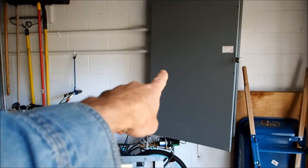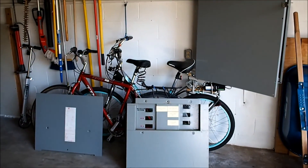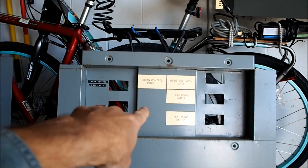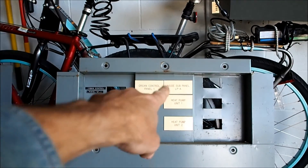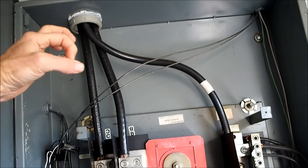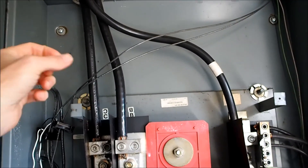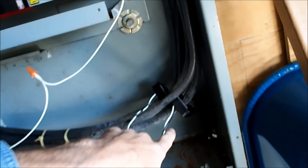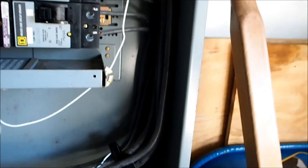This is the primary breaker box — it's monstrous. As I showed you last month, this used to be a pipe organ house, so there's a separate breaker just for the organ, a couple more for the heat pumps, and a standalone breaker for the power that goes to the main panel. The advantage is I've got tons of room in this first box, but the disadvantage is these cables that come in are monstrous — about one inch thick, 24 millimeters — which is just a little bit too wide for the standard current clamps that come with these monitors. They can do about 18, maybe 20 millimeters.